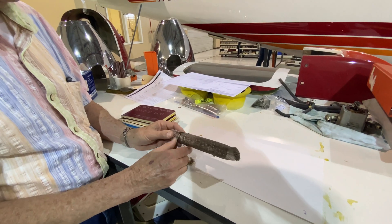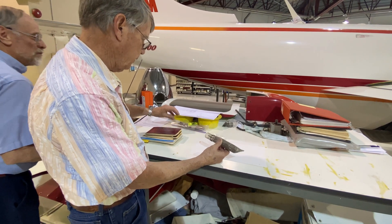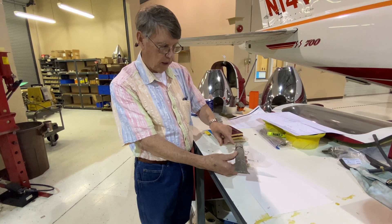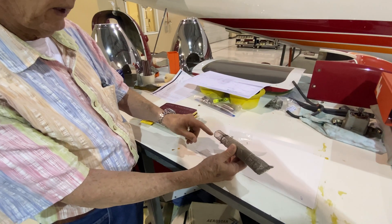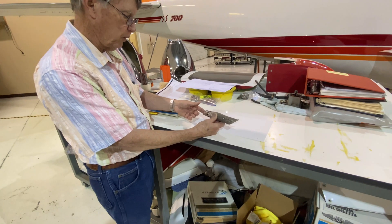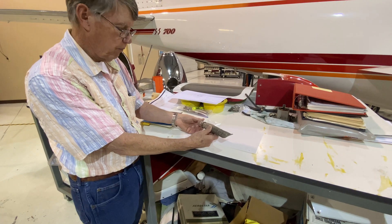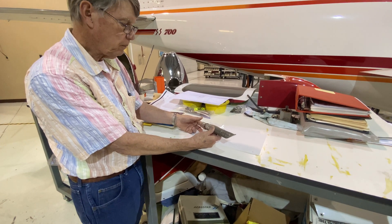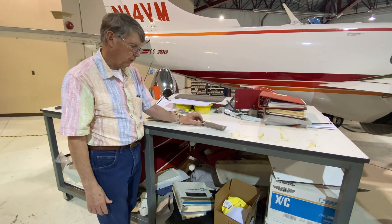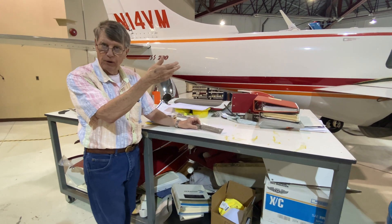There is a service bulletin on this. This piece slides into the aluminum tube, and the aluminum tube goes back behind the wing all the way to the sump of the engine. If you have any water in the wing, it can accumulate in one of these little gaps between the stainless steel and the aluminum tube, and you can get dissimilar metal corrosion on the tube. It can corrode a pinhole through the tube, and when it does that it starts leaking fuel — and it's hard to tell where it's coming from. I think they might have had a pinhole in that aluminum tube, but they cut the access holes in the wing because they thought it was somewhere else. That explains it.